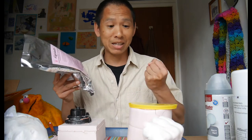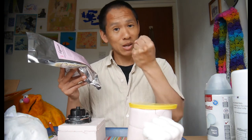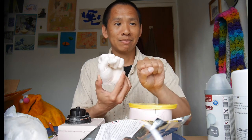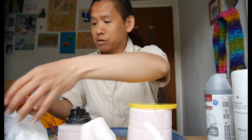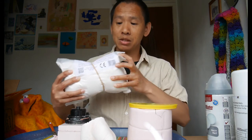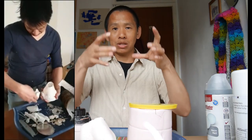Originally I'd intended this to be an open-handed model, but very soon into the alginate process I realised there wasn't enough mixture, so I closed my hand and made a fist instead. It would have been better to be better prepared, but you can only do so much and really I'm just doing this for fun. Then I mixed up a batch of plaster of Paris per the instructions and poured that into the alginate mould. I used Mould Master Fine Casting Powder — this stuff sets in about 20 minutes and then you can very carefully cut away the solid alginate.